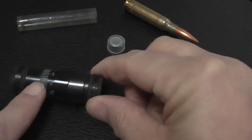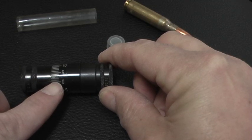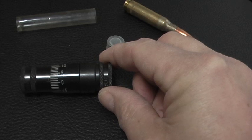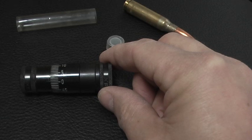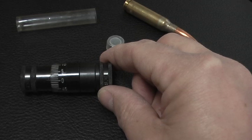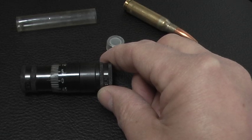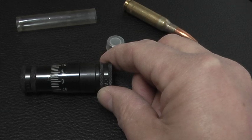There's our little index mark. We can see that the fired case ends up being, in this particular instance, four thousandths longer than the unfired case. This is significant because with a semi-auto gun, your brass is going to be ejected and it's going to be longer than your actual chamber dimension. I'm quite sure that the Marines' match grade M14s were not chambered to a 1.634 dimension — they were 1.630 right on the button, possibly 1.631, never any more than that, or those barrels would have been pulled from service.